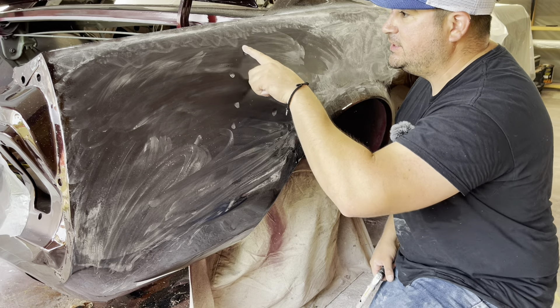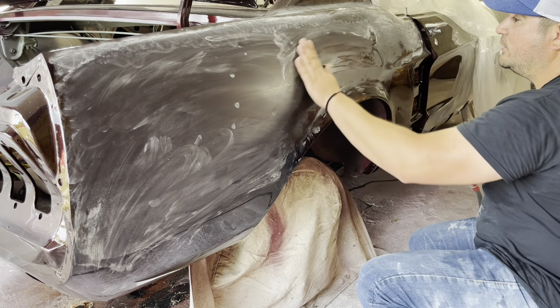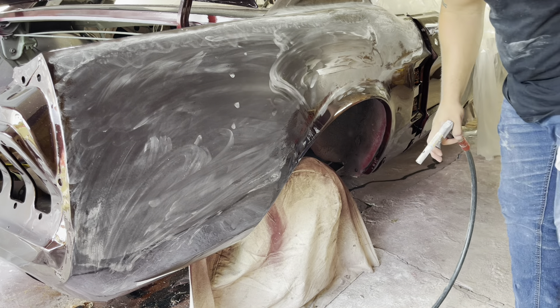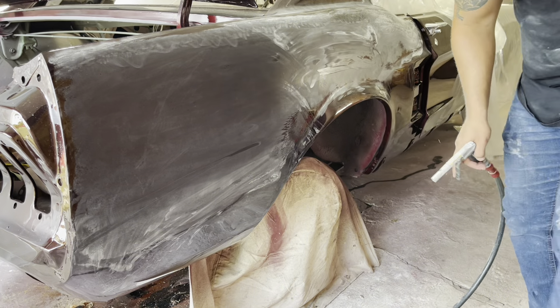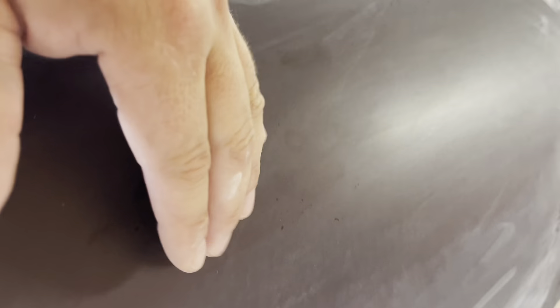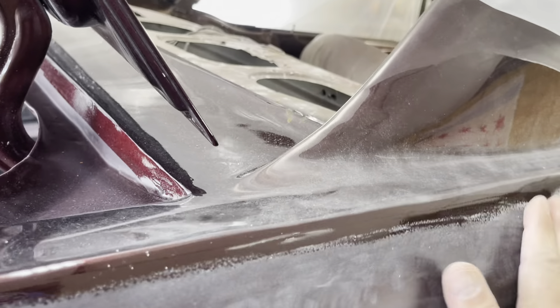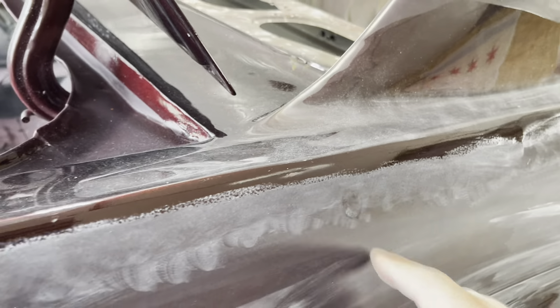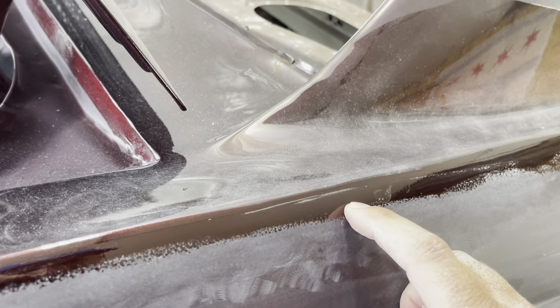You can use air, then a quick wipe, or get yourself a rag — not a good one, preferably — and give it a quick wipe. This is what you want: flat. Where it's still shiny is where you need to go back over. It's easy to see with decent lighting. I never get close to the edges — I am so chicken about burning through on the edges. I just come up as close as I can and then polish it. It's not worth burning through.